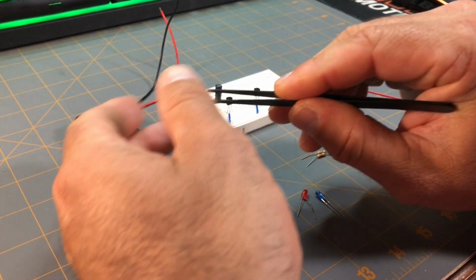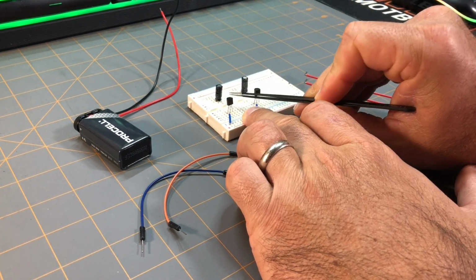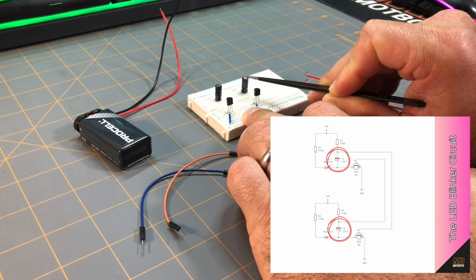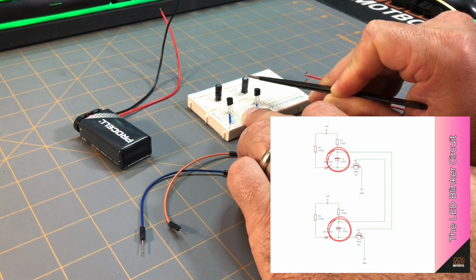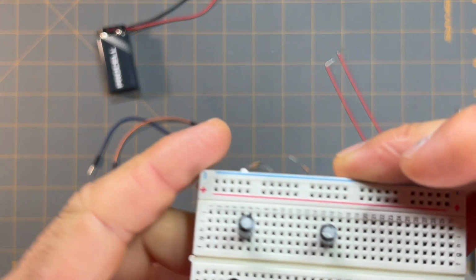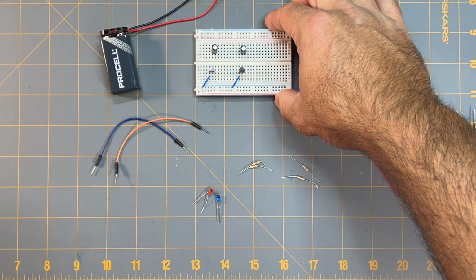And I'm going to take the second 10 microfarad capacitor and place its leads into column H, rows 15 and 16. So just so you know, I have the cathode of this capacitor representing C1 from the schematic, its negative lead going into column H, row 6, and capacitor C2 as referenced from the schematic from the website. I'll also provide that schematic down in the description below. This capacitor C2, its negative lead is in column H, row 16. And I'll give a close-up view of what that looks like so far. So this is how the circuit setup is as of right now. So we'll continue on from there.